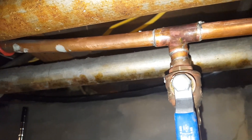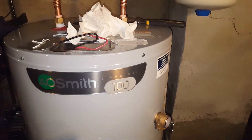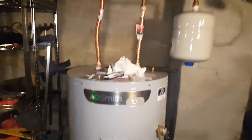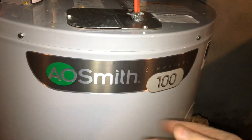I have checked for any leaks in my connections. Expansion tank is up. And then when I flip that breaker on, this will be on, and these elements will start — but they need to be filled with water first before I could do that. So that's why I'm filling this up right now. Most importantly, this is filled with water. You cannot turn the power on when the tank is empty because these elements will burn out. So now it has water in it, so I'm going to turn it on and it's going to start right away to heat this water.